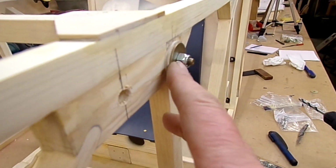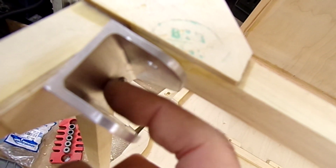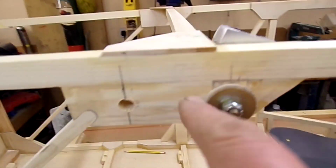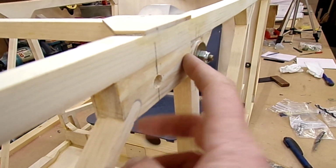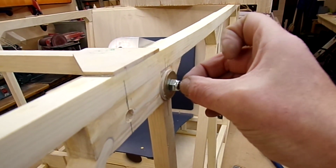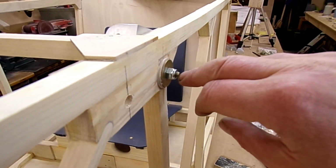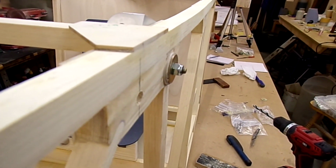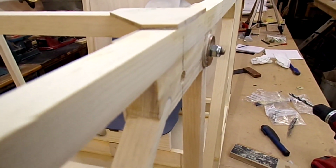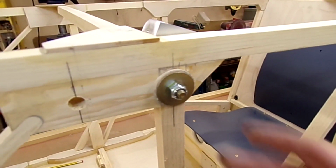So the way I've got it set up at the moment, let's have a look. This might show you the order of parts. I've got the head of the bolt there with a washer. It's not a standard washer, it's a bit of a thin washer, but it could be a standard washer. I've got the plywood packer there to act the same as the plywood skin, so we've got the right thickness. We've got the bushing in, we've got a penny washer, and this Nyloc Nut. I've got lots of AN4 aircraft grade Nyloc Nuts, so this one's just being used, been backwards and forwards. It's no longer usable, so it'll do for what we're doing at the moment. And we've got enough threads now showing it's now in safety, so I'm happy. I could go to a standard washer and still be in safety, so hooray. So AN4-15A bolts to be used.